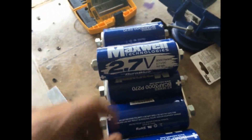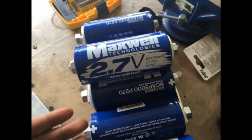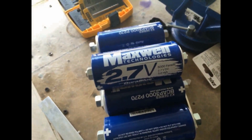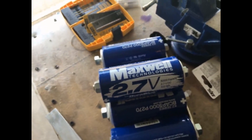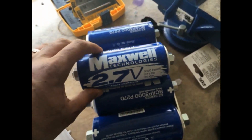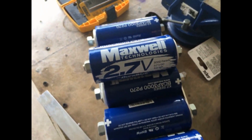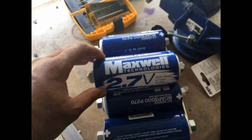As a point of safety: if short-circuited when fully charged, one capacitor has the ability to generate over 9,000 amps. These capacitors hold a lot of power — not necessarily a lot of energy in terms of energy storage, but a lot of power, meaning you can deliver a large amount of power in a short period of time.